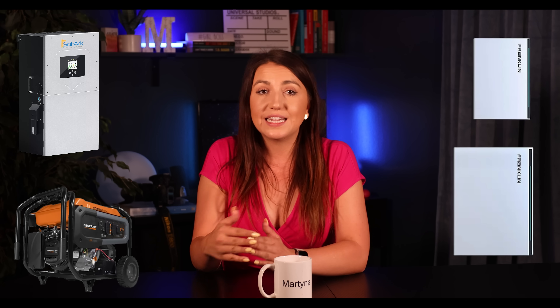A few additional considerations for battery sizing: you also have to think about future energy needs. If you plan to add an electric vehicle or expand your home, factor in the additional power requirements — it is better to have a slightly larger battery capacity than to find yourself needing to upgrade sooner than expected. Lastly, if you want to be fully prepared, go for a battery system that allows for generator charging. A lot of brands are already implementing that option, such as Solark, EG4, and even Franklin. That way, during an extended outage, you can roll a portable generator outside and power your whole home. Lots of homeowners are also asking about vehicle-to-home, the V2H option, coming with things like the Ford Lightning or the Cybertruck.